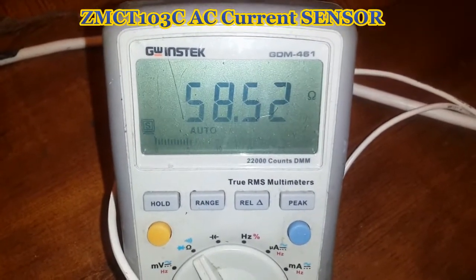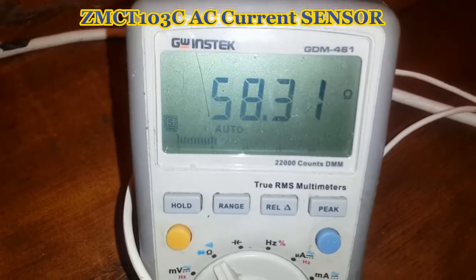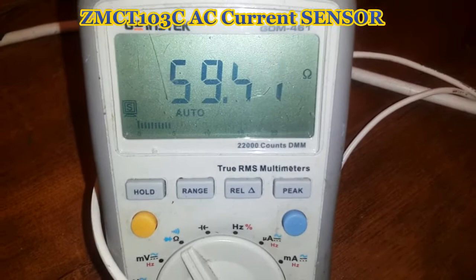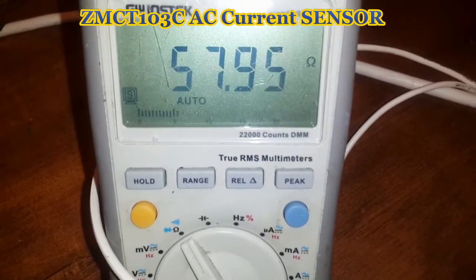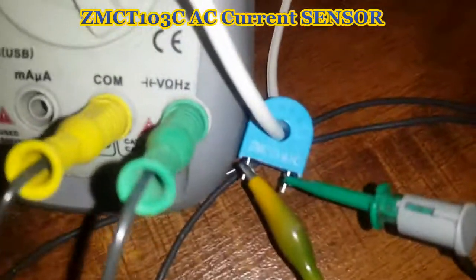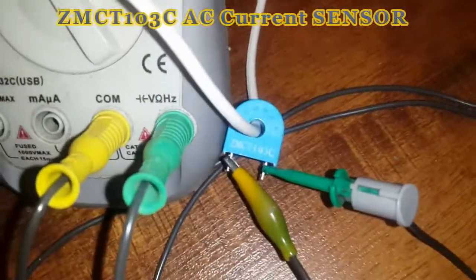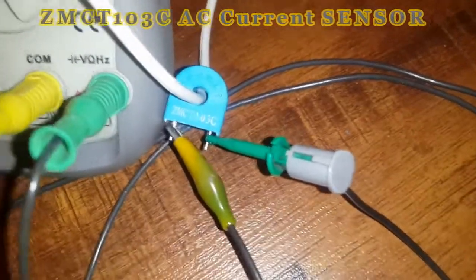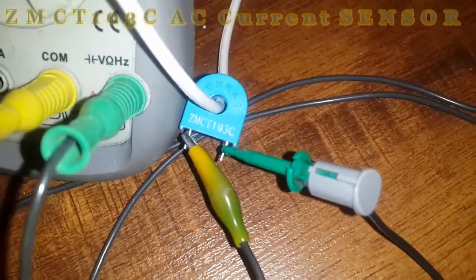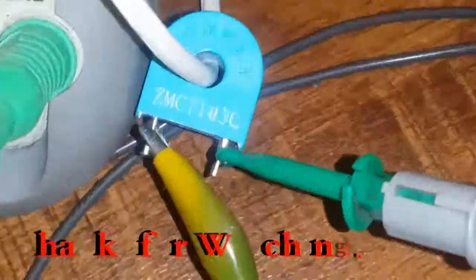This is disconnected. I will connect again — you can see as soon as the power is connected we get a nice peak. Look at the number — very nice, we passed 68-something as the peak. It means that this tiny, inexpensive sensor is working pretty well. I'm going to connect this sensor to an op-amp OP07 and we'll make one more video. Thanks for watching and goodbye.